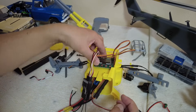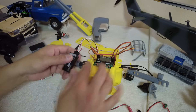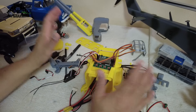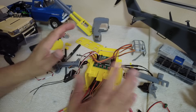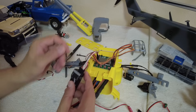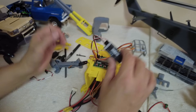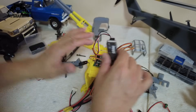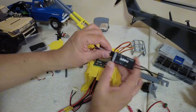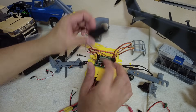If you don't use channel 5 for flight modes, you can configure your KK board to stay in auto-leveling mode all the time — and that's what I highly recommend, because auto-level is definitely going to help you fly this thing better. Without auto-leveling you will be dancing with the bicopter — doing cha-cha without self-stabilization — so keep it always on.